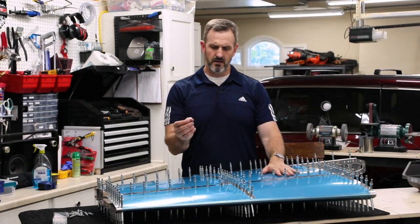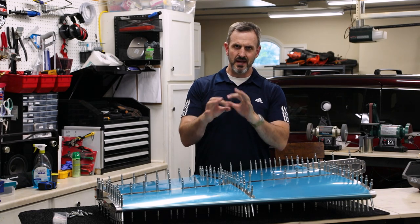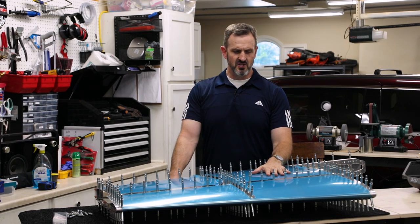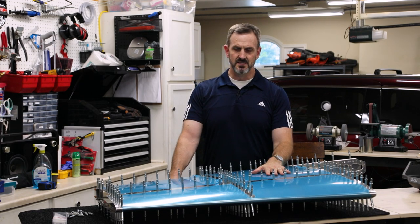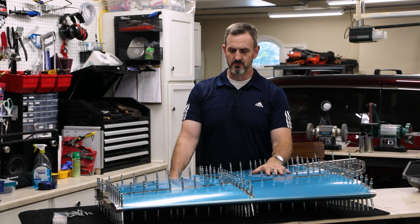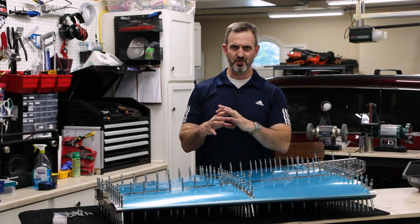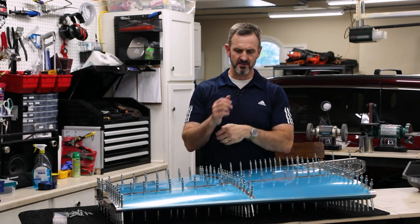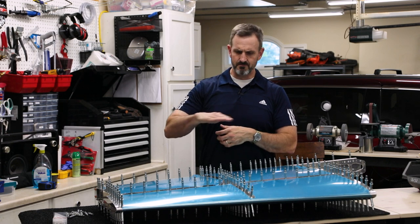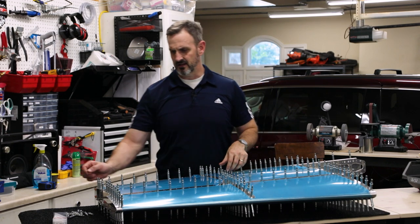But I was noticing that rivets wouldn't go in there. I took some rivets and was trying to fit them in, and the holes are slightly misaligned in many cases. In the instructions, it does say final size drill, but each of the individual holes are large enough, and I didn't want to do any kind of final drilling that would make it easy to put the rivets in, because I think it would lead to some of the holes being oval-shaped.